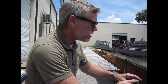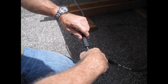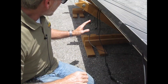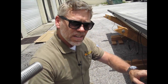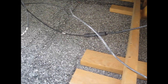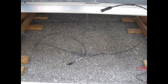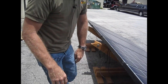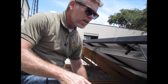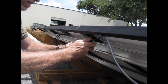We want to put these in series — that means positive, negative, positive, negative, positive, negative. These have been modified so I can quick-connect them. Now we have a circuit. We also have a home run cable so we can short-circuit these things to test current. So we have four modules at just over 30 volts each, so we should be a little better than 120 volts total.